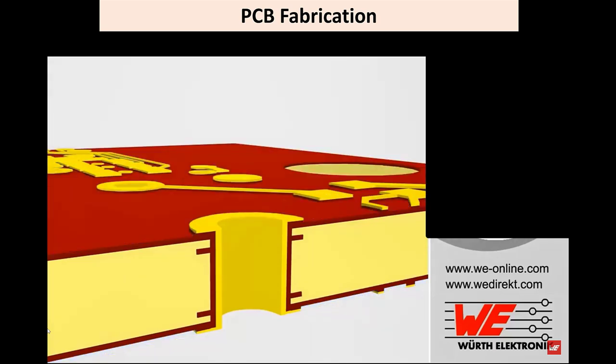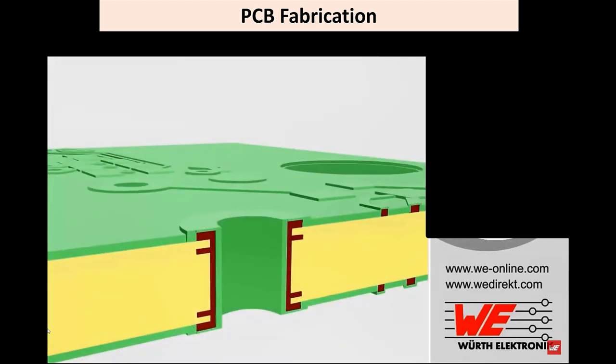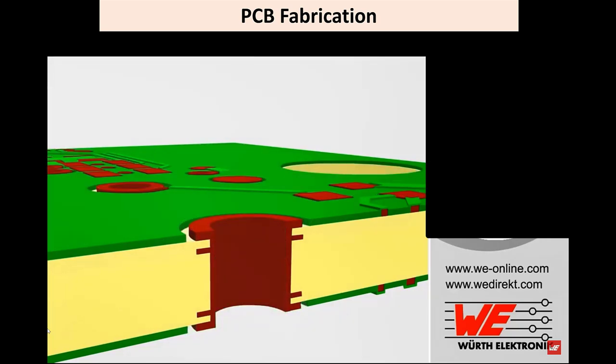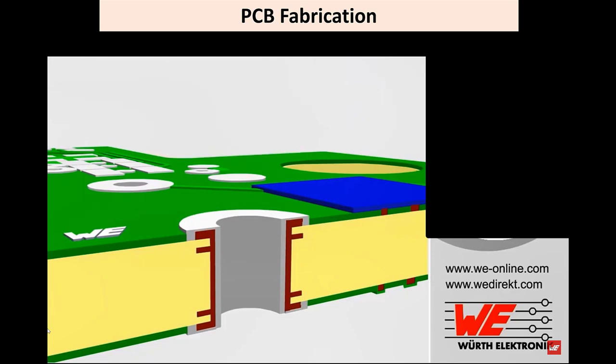removing the photoresist, removing the copper not covered by the metal resist, typically tin, removing the metal resist, applying photosensitive solder stop layer, applying and exposing the film again, developing the material, applying a solderable surface such as chemical nickel gold, covering the solder mask layers, labeling with screen printing to apply part numbers or identifying material, milling the end profile all the way around the circuit board.